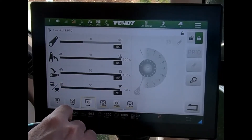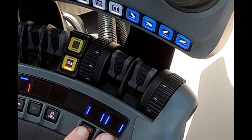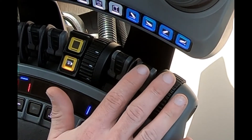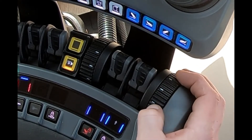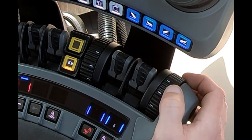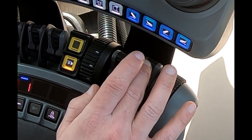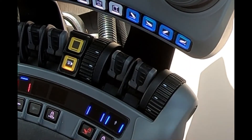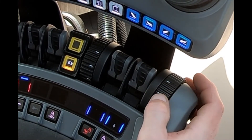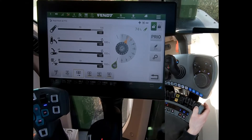If I go all the way to the top, I'm into position control. Down on the armrest I've got two buttons here — I can unlock the linkage. And then I have my depth wheel for the linkage: if I roll it back towards me I'm raising the linkage, and if I roll it forward I'm going deeper. This control module then does the lifting and lowering — click it all the way back and that will lift my linkage all the way up, or click it all the way forwards and it will set my linkage to the height I've set on my position wheel. The orange triangle represents where my working depth is going to be.